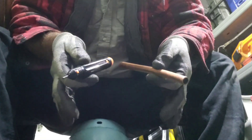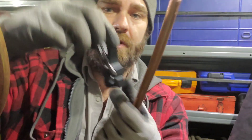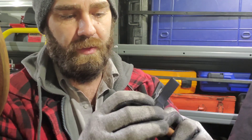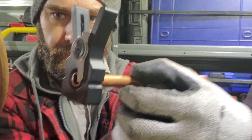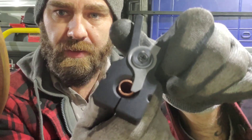We've got a clean piece of pipe here that I've already cut. You want to ream this pipe out real nice before making a flare. Our half inch block just opens up like that — spring loaded jaws. We put our pipe stop in place to gauge how far the pipe goes in, squeeze it together, and the pipe stop is stopping the pipe from going through any further. That's ready to be inserted into the machine.